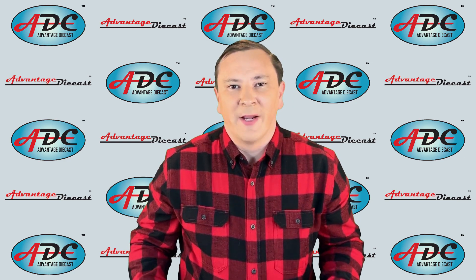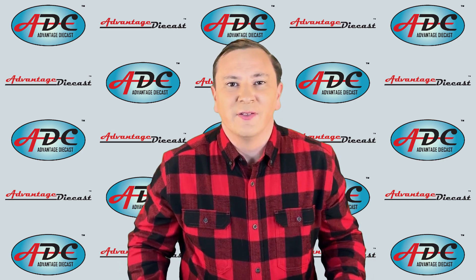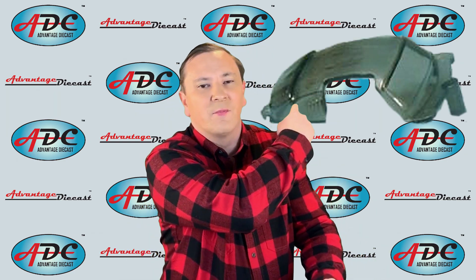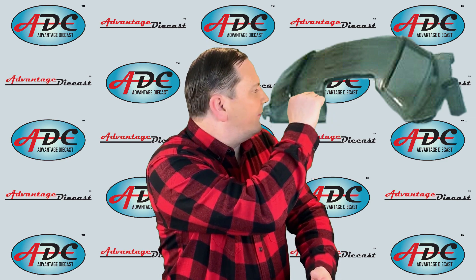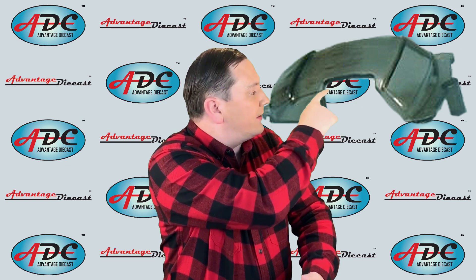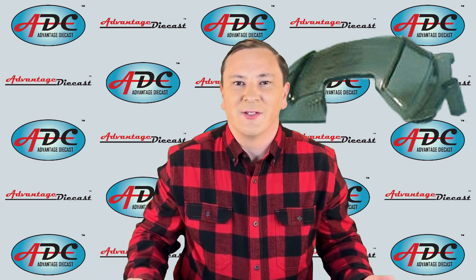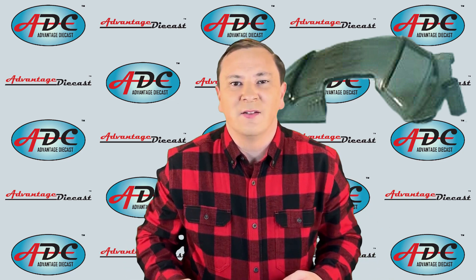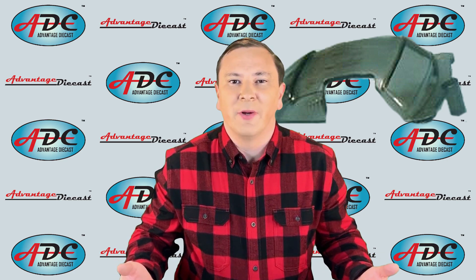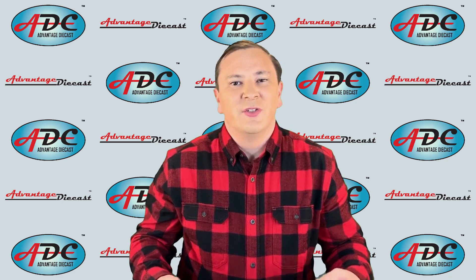We use clear plastic to make the clear windows. In inexpensive mass-produced cars and trucks such as Hot Wheels, they'll cast the windshield, side windows, and back windows all as one piece — just like this. You can see the front windshield and the back window right here. The other plastic that connects it is all hidden by the die cast body shell. This method saves time on assembly and adds a little structural support to the model, making it a bit stronger — a win-win for everybody.